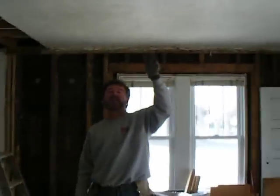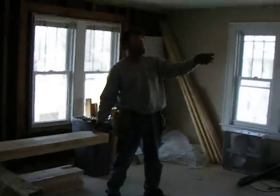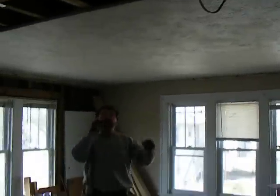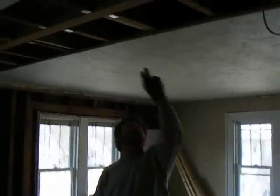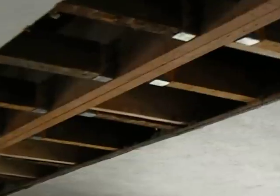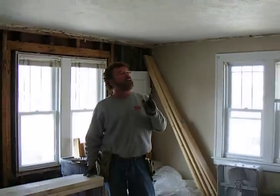We just got done jacking up the ceiling — it had a really bad sag in it. The way we did that was we put this beam across it, put jack poles in, and jacked it up. Then we both crawled up in the attic, because that's what you've got to do, and we put extra beams in across — we spoke about that in the last video. You can see it's paired up right there, the one on the outside, and it goes from that corner all the way to the end of the room.